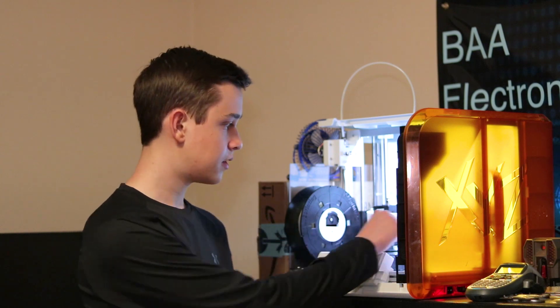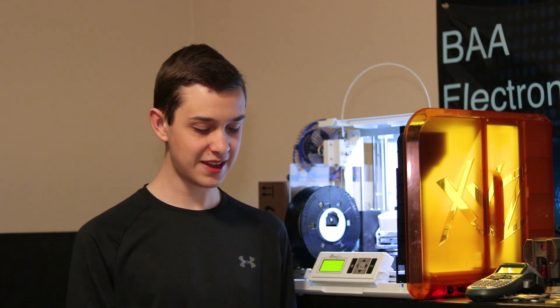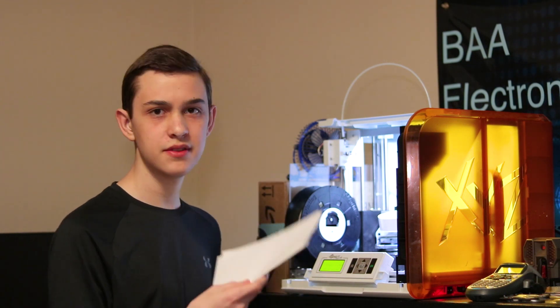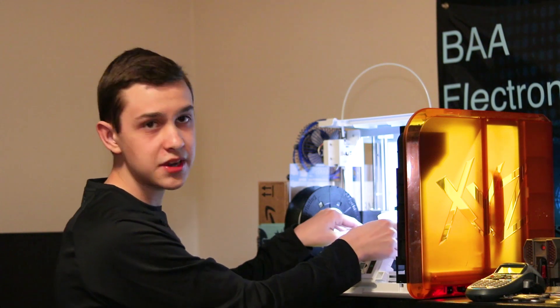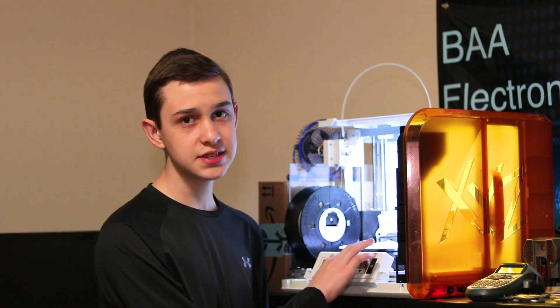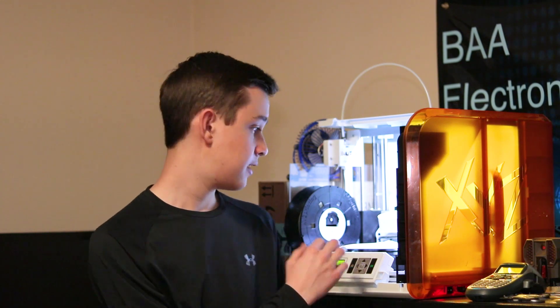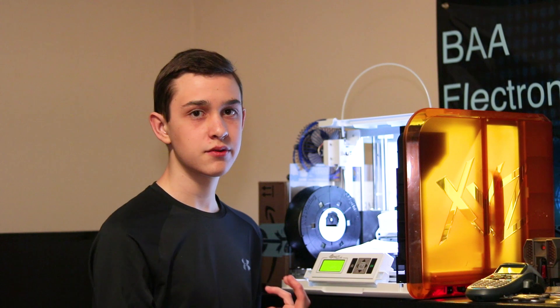One thing that would help if your filament is continually getting clogged is to check your Z-Offset. Firmware 2.2.7 makes this very easy with the new Z-Offset tool. Z-Offsetting means moving the extruder head plus or minus a few millimeters or fractions of a millimeter so that the extruder isn't too close to the print bed. When you're Z-Offsetting, pull the bed out first, move the extruder over, take a standard U.S. letter-sized sheet of paper — or really any sheet — and fold it in half. Put the two sheets underneath the extruder and make sure they can slide in and out with ease. If they can't, your extruder is too close to the print bed and you should move it up. With the newer firmware, as you adjust the offset, it will move the extruder up and down so you can see which position works best.